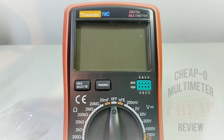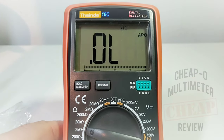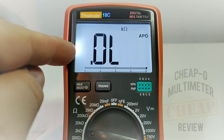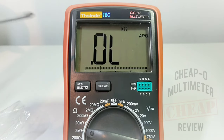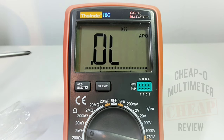Let's take a look at that display for the first time — turning it on. I like it, nice and big. Try out the backlight — wow, bright! There is some bleeding on the left-hand side, but it's still really bright and bold. Look at that bar graph display too. This is a 4000-count multimeter; update refresh time is three times per second. For a cheapo meter, kudos for the bar graph.